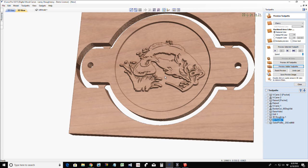But if this were a flat-bottom bowl, then I would definitely use a raster toolpath. If it was a pocket of some sort, I would do an offset toolpath, but I generally always raster because you always want to carve with the grain. Less cleanup, less sanding and all.